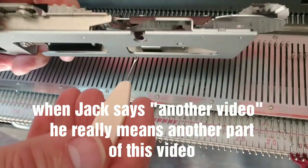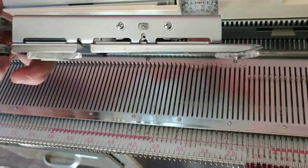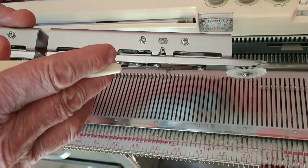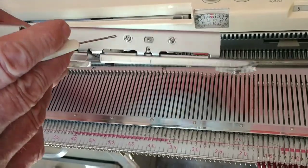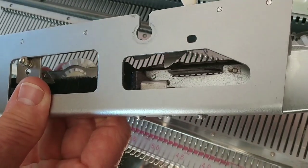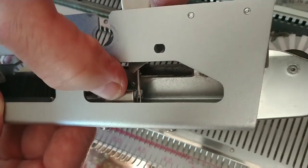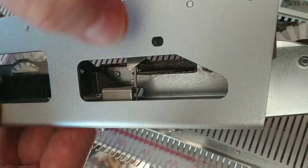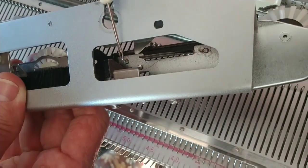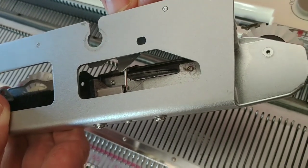What we found out in testing — we talked about the position of this hole in its little keyway slot. This is the one that Catherine's been using on her bed. I adjusted the one I just finished working on, which had a number of problems, but when it came to adjustment I adjusted it just like this one. When you get it on the bed — this is the cam that we adjust with the screws. Here's the needle — the one that comes forward. It comes over here, and it stops when it gets to that timing cam. In order for it to proceed on, this cam is pushing it down. The minute it gets to the end is when it's going to pop down. The position of this cam and the pressure it puts on it tells that needle when to drop — it must cross the needle that's going to receive the stitch.